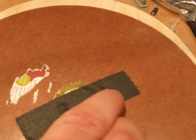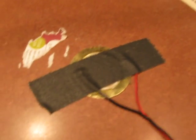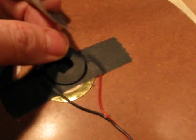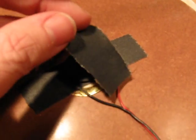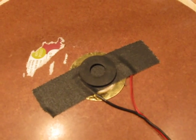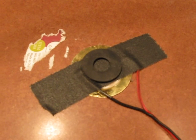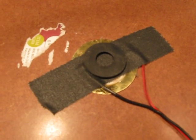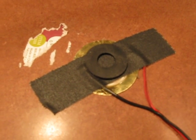The reason these had tape inside the machine, I think, is to actually hold the thing down. So I'm kind of doing that. I'm putting this rubber washer here and this rubber washer here, and I'll tape this down. That should make it so that nothing rests on that solder joint, and whenever a shock does hit it, it'll only be very slight because it's coming through the rubber. And yet the piezo will still be in contact with the back.